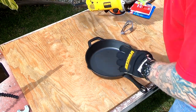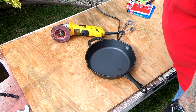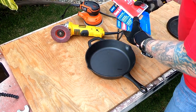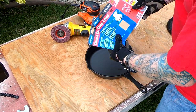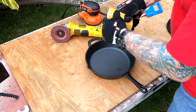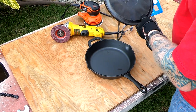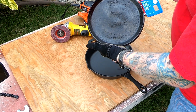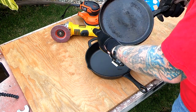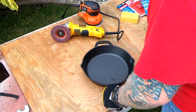What we've got to work with today: I'm going to be using 80-grit on a 4-inch sander, 100-grit on a random orbital sander, and some 150-grit to finish up the edges by hand along with the radius areas using a sanding sponge. I also have this little brand new skillet by Natural Elements — my wife likes to use it for breakfast, frying up eggs and browning things.